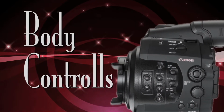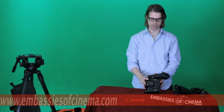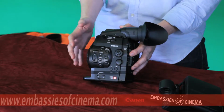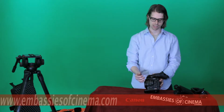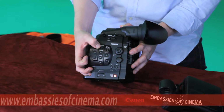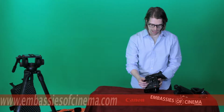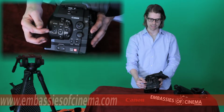Another major difference and significant advantage that the C300 has over DSLR shooting is important body controls of camera features. The C300 is designed to be a professional motion imaging device, and as such has plenty of body controls on the left side of the camera. You can see here you have your magnify for focus assist, you have peaking controls, you have zebra controls, and you have your waveform controls right here on the camera body, as well as your ND filter controls.